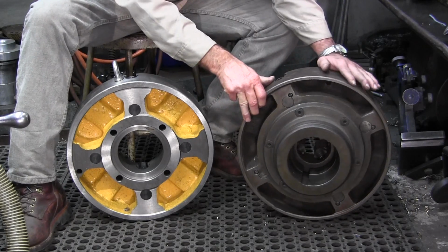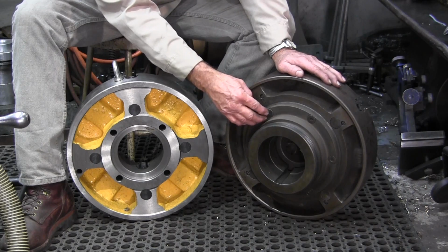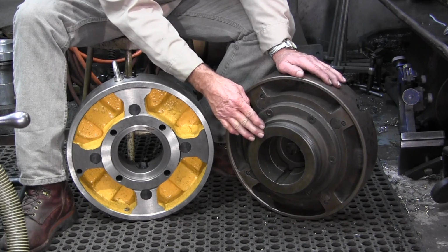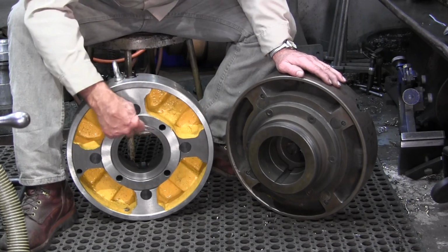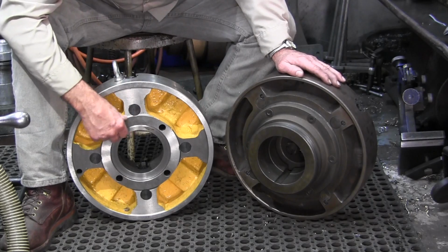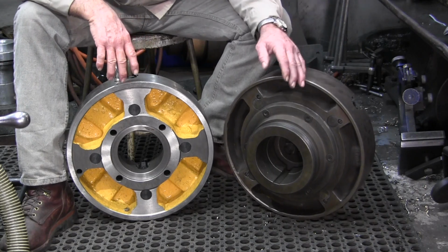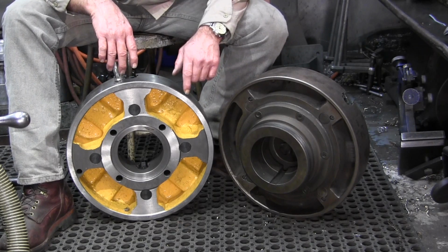Now this, I actually ordered this blank and did the machine work and mounted this chuck on here, and I'll be able to pull these screws out, put this back on the lathe, and I will do whatever it takes to modify that into this surface right here, turn this OD down to where it comes in comfortable with this minor area here where the cavities are, and then tap it out for the 4 holes, and then run the bolts in from the other side.